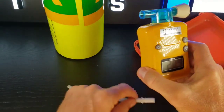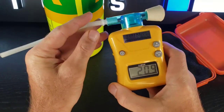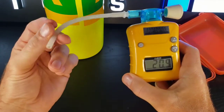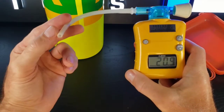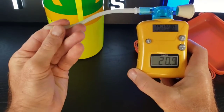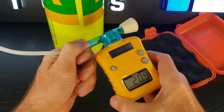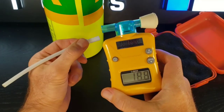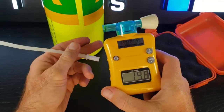Let's say we want to use this for an oxygen concentrator or to test in-line with our scuba gear. You just pop the coupler on — it fits very snugly — and you've got the silicone tubing. You could further add a small regulator and do real in-line oxygen sampling with your scuba equipment, or pop it onto your oxygen concentrator. I'm going to breathe into this real quick — you're going to see the numbers go down because we're breathing. We have a depletion of oxygen, and it's responding very, very fast and coming back pretty quick too.